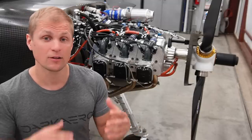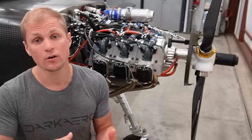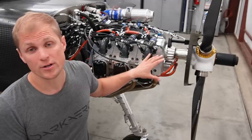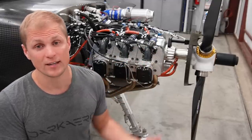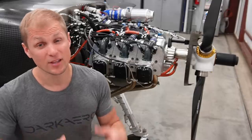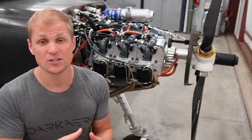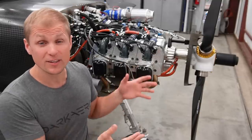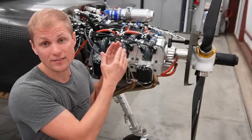You can take this a step further and look at the amount of fuel the engine will burn over a given mission. We did find engines with a better power-to-weight ratio — small turboprop engines — but when you look at the massive amount of fuel these engines burn to fly a long-range mission like we're targeting, the weight of everything starts to tip back in favor of the engine we chose.